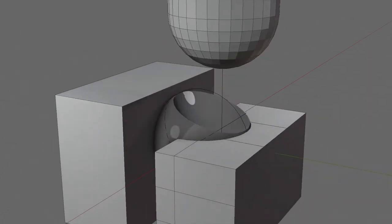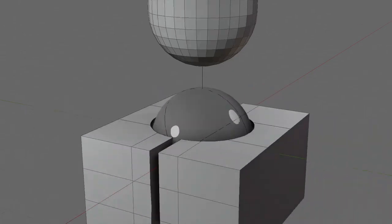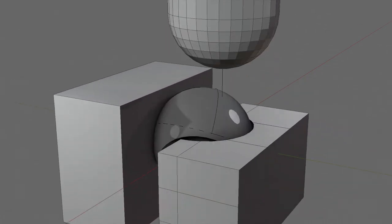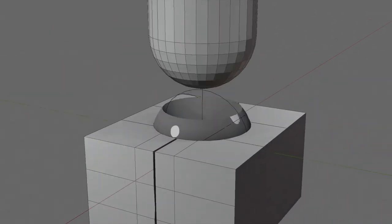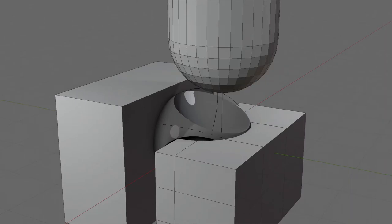All right, this is a quick video showing how to make a tetrahedral dice out of a sphere, like a ball bearing. It's pretty straightforward. You just need a milling machine and a couple blocks of aluminum and a ball end mill that has the same diameter as your sphere.